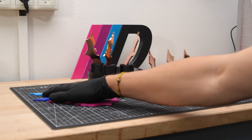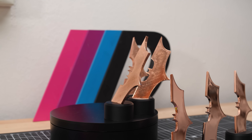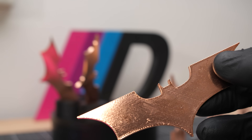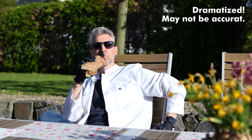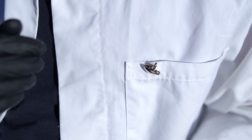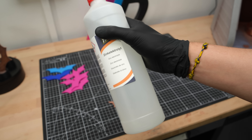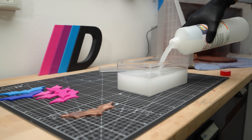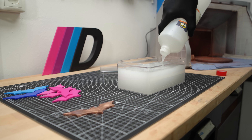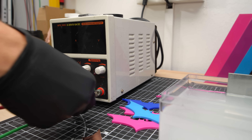Now for the interesting part. You can achieve surface diffusion on the copper by electroplating a thin layer of another metal onto it. Those atoms then slowly diffuse into the copper, creating a thin alloy layer — I wasn't aware of this effect before and happened upon it by accident. First, I produce brass. For that I need a zinc electrolyte. A ultra-thin zinc layer is enough; under heat it diffuses superficially into the copper forming brass. The setup is just like copper plating: fill the tank, then hang a zinc anode instead of a copper one.